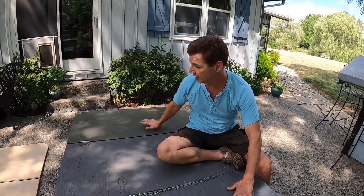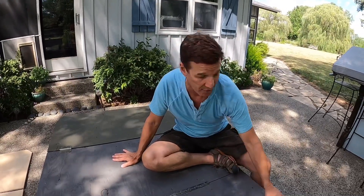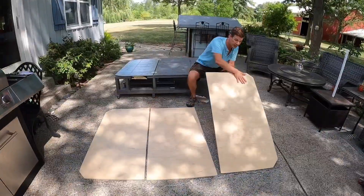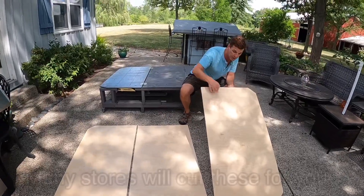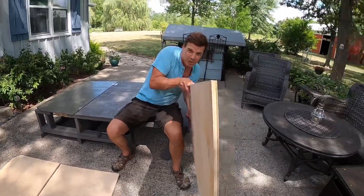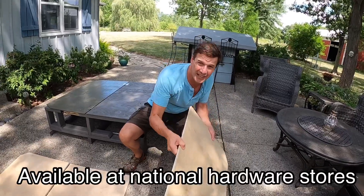To start this project, we're going to cut three sections of plywood that match the exact size of the mattress. That allows you the flexibility of the tri-fold frame. We cut three sections of plywood, two foot by four foot, and they're one-half inch birch, which is incredibly straight and true.